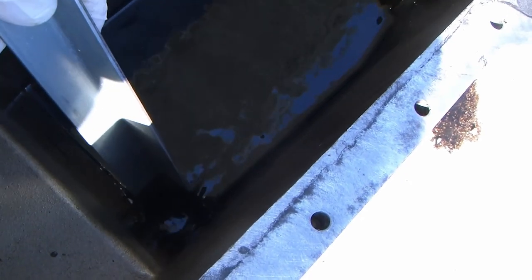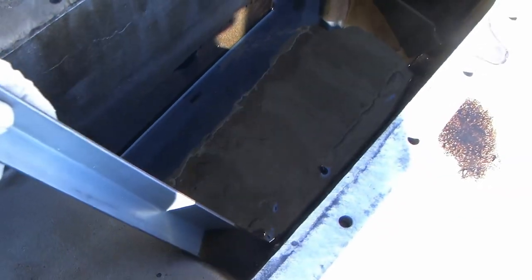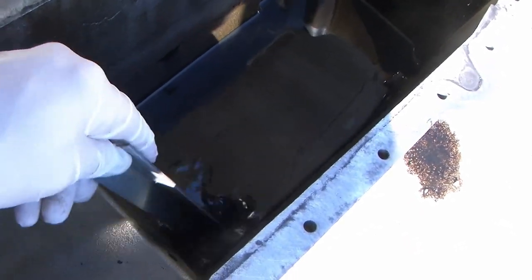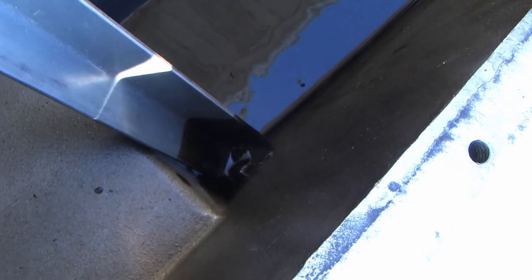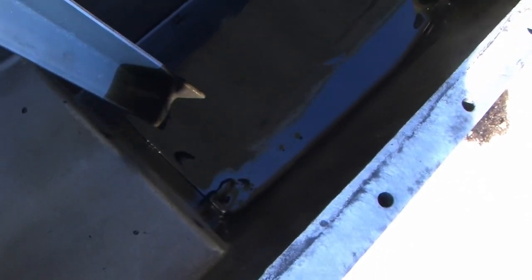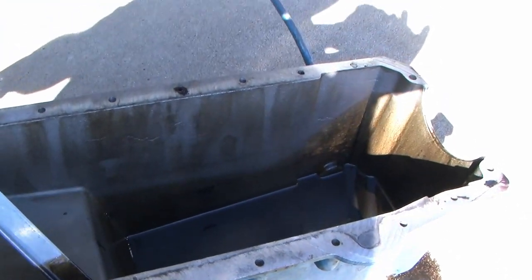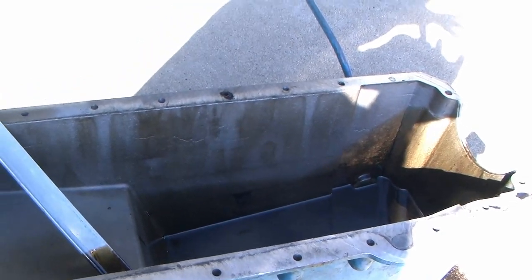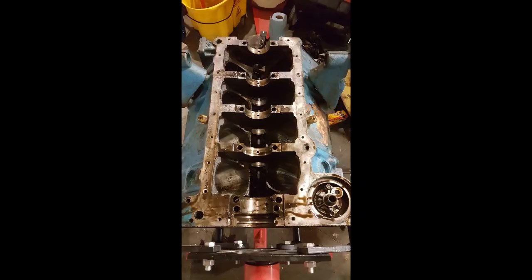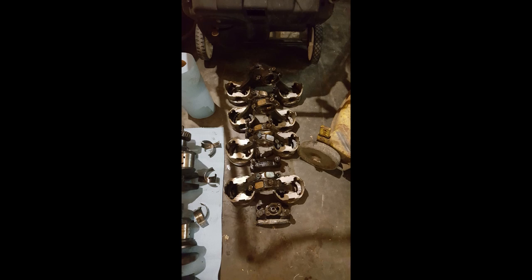It's almost like mud — this is the problem and why it spins bearings, because this oil is just mud, and that is not normal. We're going to end up dropping the motor on the other side of the boat too, because if this one's got sludge like this, that other one's got sludge along with who knows what else. We got the engine apart and found out bad winterization caused a cracked block, which caused it to overheat and have a spun bearing. Ultimately, we ordered a new engine.